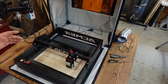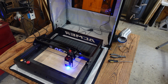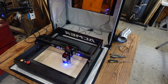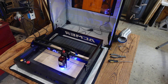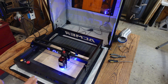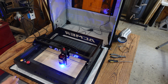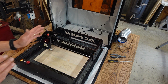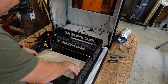Make sure the machine is completely focused because you don't want thick focal lines either. I'm running about 50% output and 50 speed just to give me a good fine line. I'm going to run these same two patterns and see what kind of results I get. If everything is adjusted properly, the machine shouldn't be grunting or whining or making any kind of noises — it should run quiet and smooth. When you get this cut done, all your lines should match up good and the spacing should be accurate. So here we go, let's see how well I did.